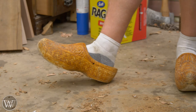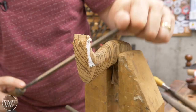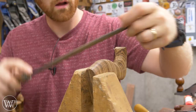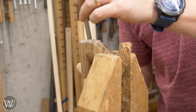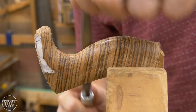It gives you far more freedom. Here we're just going to go through and clean up all the marks left by the rasp with a finer file, and then come in with an even finer file and finish it up. In total I'm only using four or five files and rasps that I like and trust, and they do the work rather quickly. You can start to see how the wood is starting to shine — that's one of the things I love about the file work. When it shines like that you can see it's got a nice smooth surface. Occasionally I'll come in with sandpaper, and if there's any nick or scratch in the wood the sandpaper dust will fill into those pores and let me know I need a file right there a little more. It feels so good in the hand because you get that natural texture that comes out with the file and the rasp.